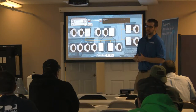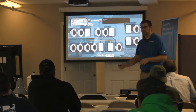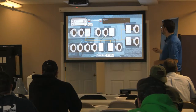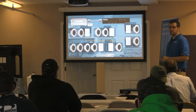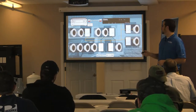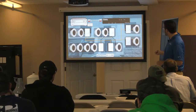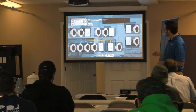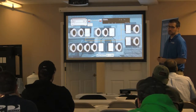So this is what this would look like. You've got your Atmos Onkyo receiver available from Skywalker AV, and you are going to go zone 2 out to your Atlas Sound power amplifier, and then take one speaker wire and run it to a bathroom, a bedroom, the den, maybe the basement, and a couple of bedrooms. You're going to put a volume control in each one of those.